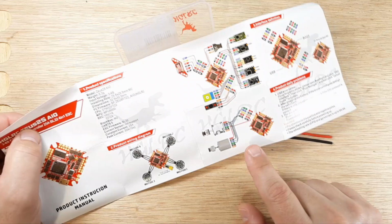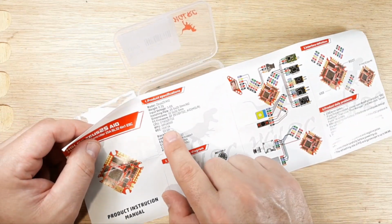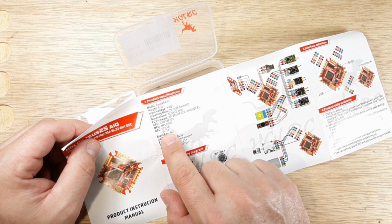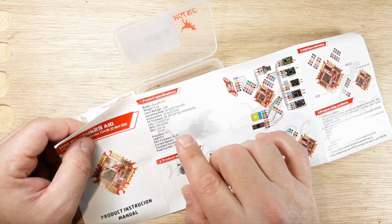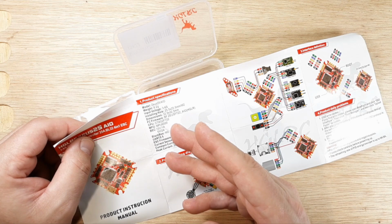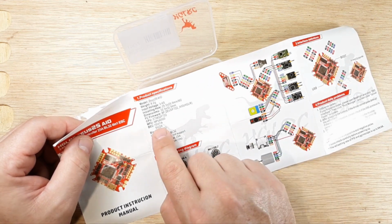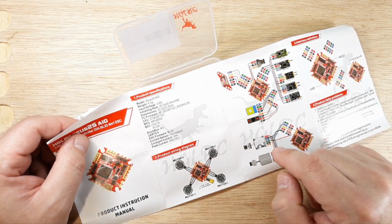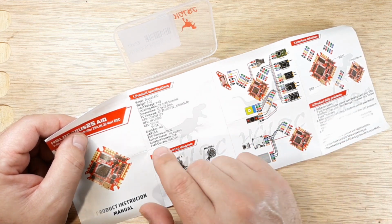But I want you to keep in mind with the digital stuff that runs off a 10 volt BEC, it's at 1 amp. So you have a 5 volt rail and they've put 2 bucks on it to make it 10 volt. If you double your voltage, you're going to cut your amperage in half. It's just Ohm's law. Look that up if you need, but 10 volt at 1 amp. You might want to watch how much stuff you put together on here. You may be close to or exceeding that.